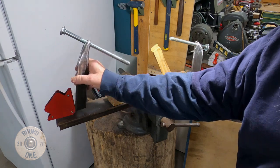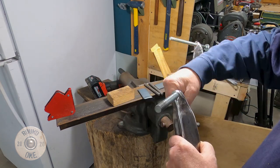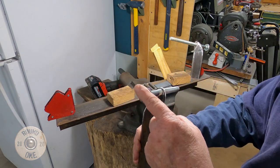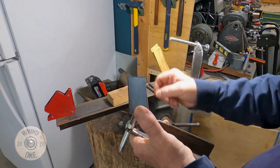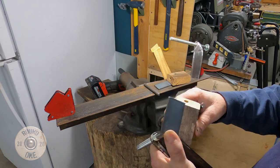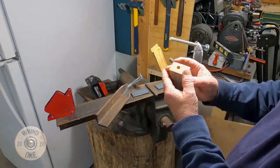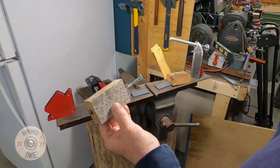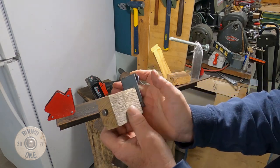What I've done is welded a nut into this piece here, then ground it down so this bolt will turn — it's still a little tight but I'll loosen that up. I sanded the carriage bolt flat on the end so I can weld it on here as a handle. Then I'm going to have a piece of wood cut and carved to actually fit on it. I'll carve the piece down and make the hole just a little bigger, but that'll go through and weld onto this — and that'll be my handle for tightening.